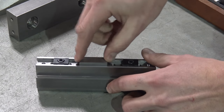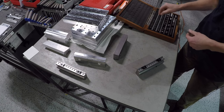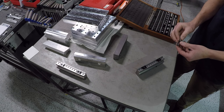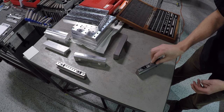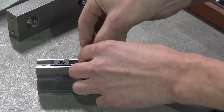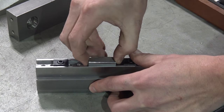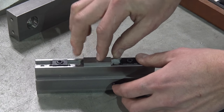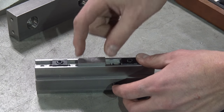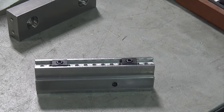it fits in there pretty well. Does a 501 fit? So if I grab a 0.4 and a 0.101, that would give me 0.501, one thou over half an inch. Does that fit? Help if I had the gauge block correct. No, I mean, I've wedged it in there, but no. So when we machine this, we're gonna walk it in again, and let's try to get it to a similar fit so that this half inch part, our gauge block, fits in there perfectly. And then we'll spot drill it, and then we'll tap it out. We should be good to go.